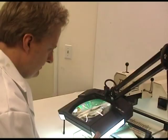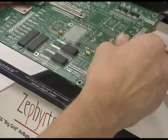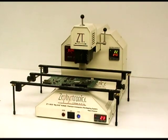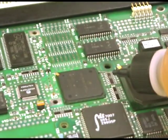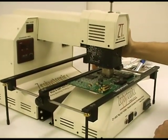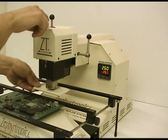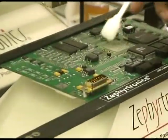The retractable heat zone gives you ample clearance to inspect the work immediately at the same site — even enough clearance for using a high-end, ESD-safe illuminated inspection magnifier. Removing the PCB assembly reveals that both the bottom side of your board and its component are undisturbed. Without any need for one of those $10,000, $25,000, or $50,000 so-called BGA machines, without excessive uncontrolled high temperature, without technician guesswork, without burning the board, without lifting a single pad, and without hours of frustration programming complicated machines, we've just successfully desoldered and removed a 289-ball, 25 by 25 millimeter BGA package — all in less than five minutes.